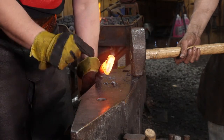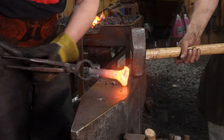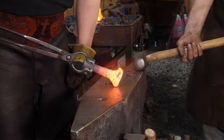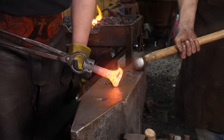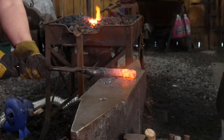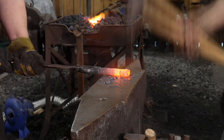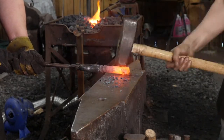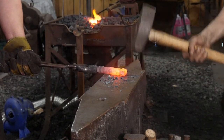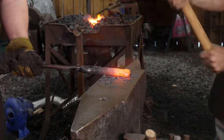Now, as we upset this bolt, we're going to keep doing that, and it's going to give us longer and longer protrusions that we can then pull our horns out of, or our tailstock, or whatever. Let's go ahead and give her a straighten up there. Go for it. Right on that transition. Out on the edge. Lighter, just more consistent on the edge.